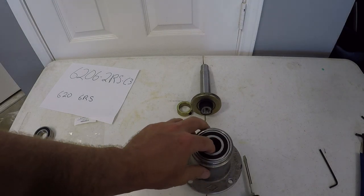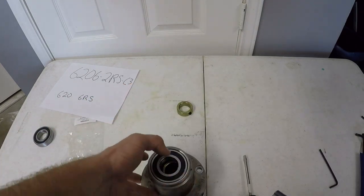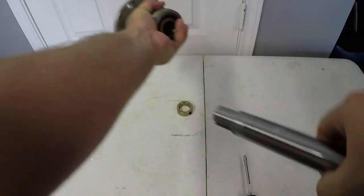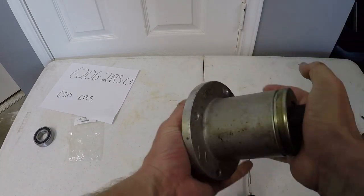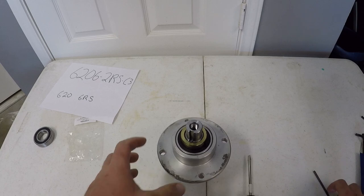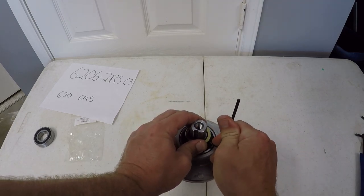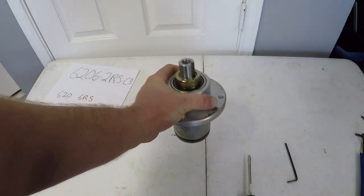That takes a little bit of love, as you can hear. Now we've got that in there, and it's just the reverse process to put it all back together. This is the business end of the spindle, down by the blades — getting this lined up is the key. That just slides right in, and the lock collar goes right back on. And voila, you just rebuilt a non-greasable spindle. That is literally it. Don't let it intimidate you.